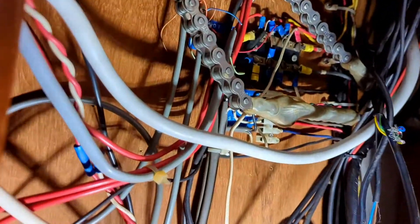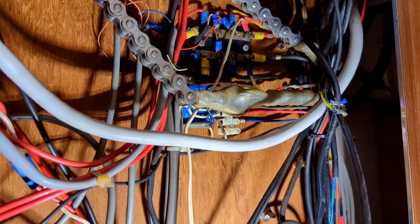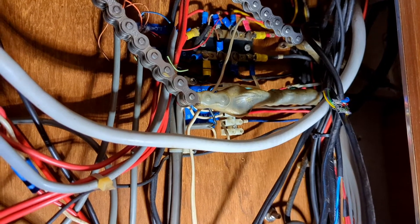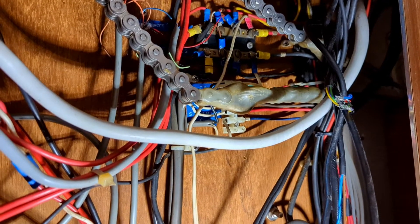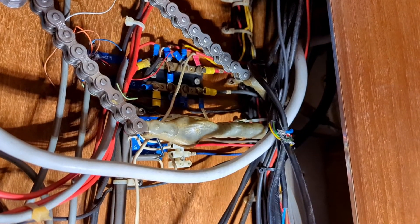Just kidding. Because it goes to the switch called 'pilot house,' I don't want to have to turn on everything connected up in there just to turn on that 12-volt power supply in the v-berth. So I think I'm gonna run it back up into the switch panel in a different way, bypassing this. Let's see what that looks like.